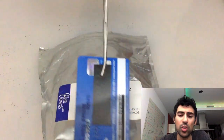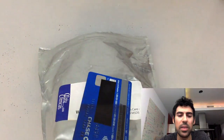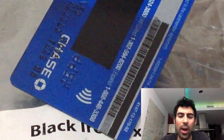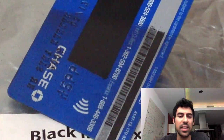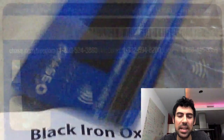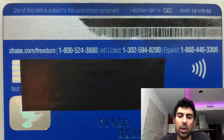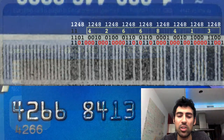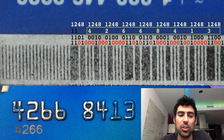There are literally hundreds of strips of magnets in the MagStripe, and they attract the iron oxide I have here. This magnetism is what a MagStripe reader is reading when you swipe your card. These strips are wide enough that we can actually extract the data off of a MagStripe with the naked eye. Let's flip the card over and look at the second track, which is easier to see. MagStripes have three tracks, however only the first two are used for credit cards.